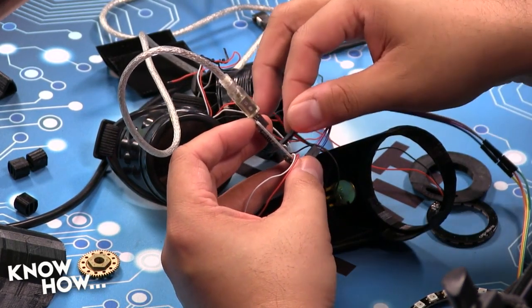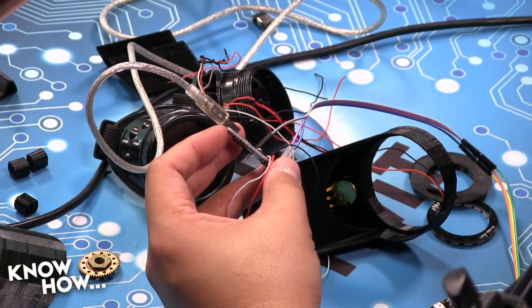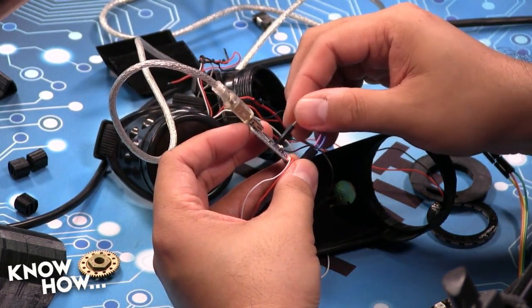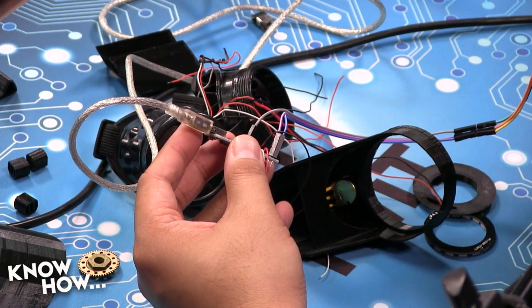You know, I'm having flashbacks to when I was at your parents' place in Vegas. Yeah, that was different, though. You put 12 volts through a 5-volt circuit. They're not supposed to get that hot, right? No, they don't. I may have cooked it. I cooked the LED ring.